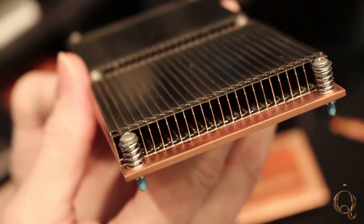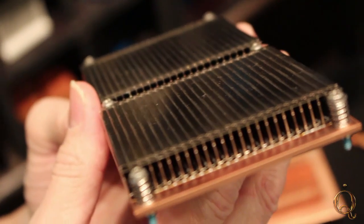Or in this case, is this push pin or something like that? Yeah, push pins would work as well. This is actually hard mounted onto the board. This heat sink is cooling many components — actually about 12 total components on the bottom. So this one spreads the entire length and utilizes the copper for spreading. And again, it was that weight factor we wanted to reduce, so we used aluminum fins, which need to be nickel plated when you solder. These two others are obviously different applications but they also use a zipper fin.